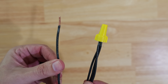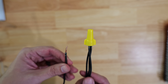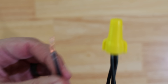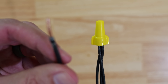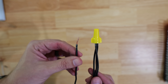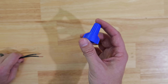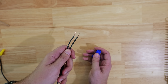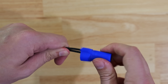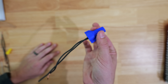One of these wires is going to be extremely easy to pull out — and there it is. The first clue that you're overloading a wire nut is it's going to be very hard to get all the wires to actually seat up inside of it. Once you get a wire nut on you should always give the wires a pull, and if you've overloaded it, more than likely you'll get the result I did. On the flip side, somebody might be using a bigger blue wire nut with only two 12 gauge wires — they'll tighten it down and the wires won't just fall out, but with any force at all pulling on one of these wires, they're just going to fall right out.